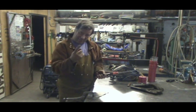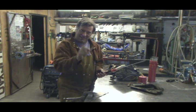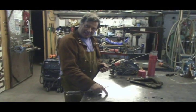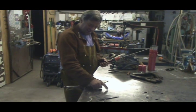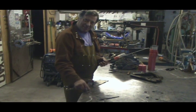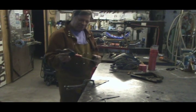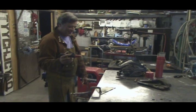Remember, this thing is getting shorter all the time. An easy way to practice: take your finger and scratch it on the table, get your arc going, and you've just got to be able to hold that distance above the table. That's part of it. And then remember, you just have to feed in. It's really easy once you get started.